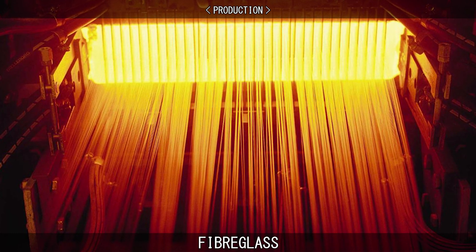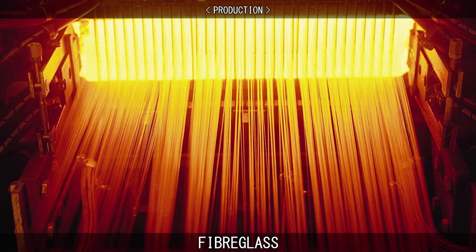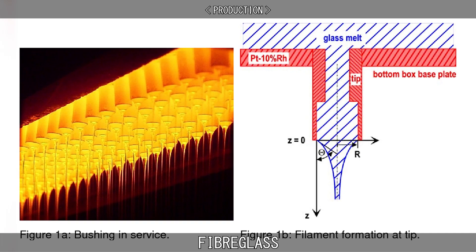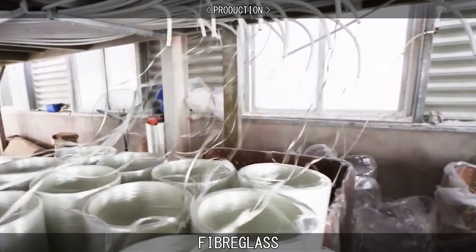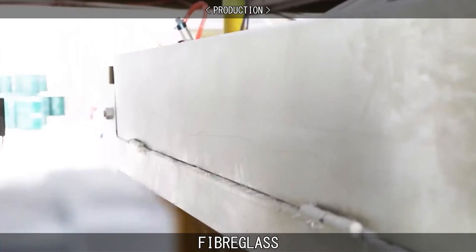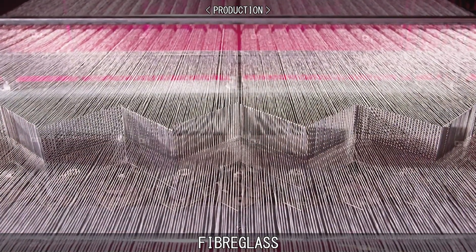The manufacturing process for glass fibers uses large furnaces to gradually melt down silica sand and other minerals until all are in liquid form. It is then extruded through bushings, which are bundles of very small orifices. These filaments are then coated with a chemical solution. The individual filaments are now bundled in large numbers to provide a roving. The roving is then either used in filament winding which produces pipe, in gun roving where an automated gun chops the glass into short lengths and drops them into a jet of resin, or the rovings are used to manufacture fabrics.